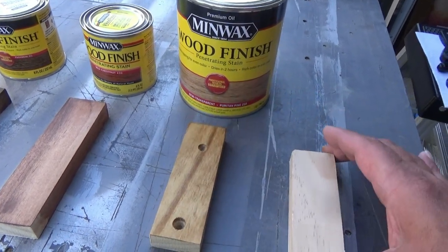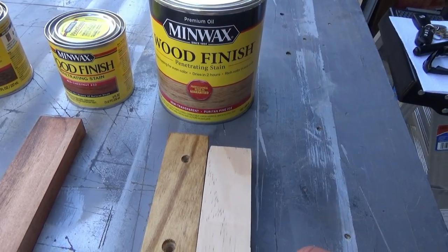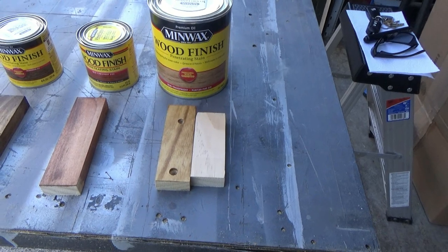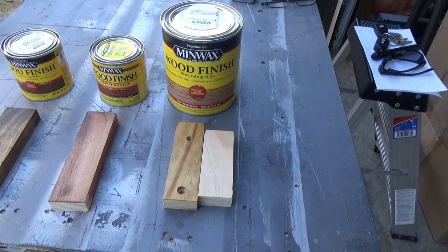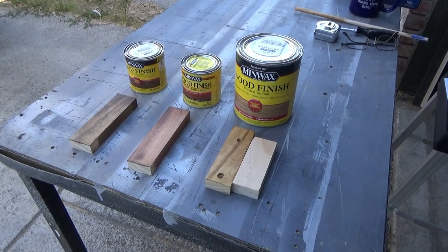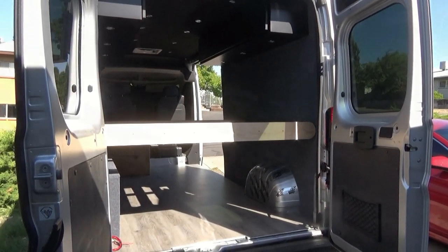It's a lighter color. This is the original pine, what it looks like without any stain. And so we are just a shade darker than that, which is what I am gonna use. I like the looks of that, and I think it will give a nice contrast when it's all in place, furniture, and yep, the overall warminess of it, if warminess is a word. Okay, so let's pull these out, sand them up, and get this stain on it.